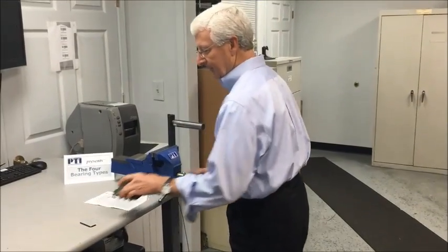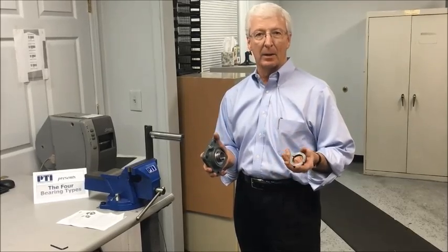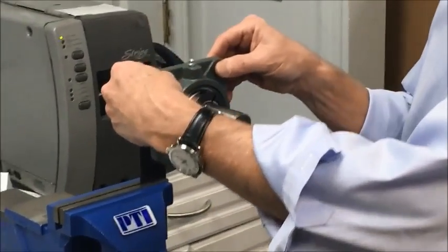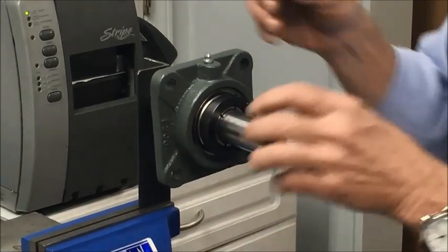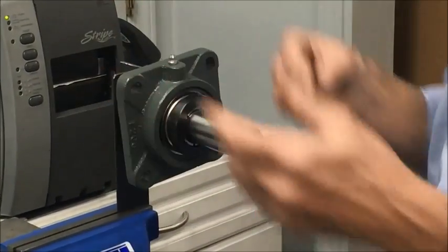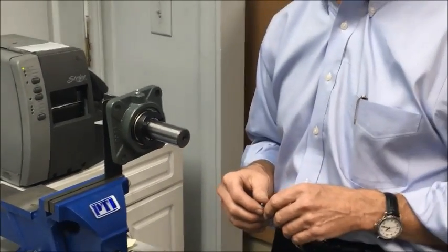The third method of attaching a bearing to the shaft is a concentric locking collar. The inner ring has tangs that clamp down in a uniform fashion when the collar is tightened into position. It's a slip fit on the shaft; once the bearing is positioned and bolted to the frame, the locking collar is tightened using an Allen wrench, with a torque wrench advised. After 24 hours of operation, it's prudent to go back and double-check that it stayed tight.